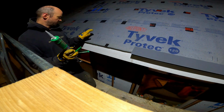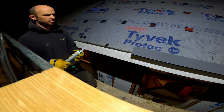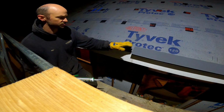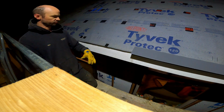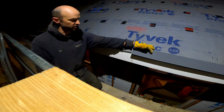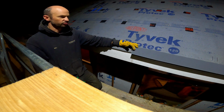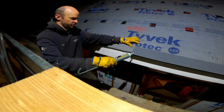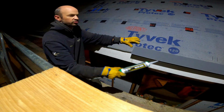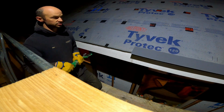Checked and tuned up the fit on the middle piece, made sure it was gonna go. And now, gonna put some roof sealant on these. So these are one of the few places in the roof system where no water should ever get here. But if it did, it could travel laterally and find its way through a seam. And so you just do vertical stripes, continuous beads of sealant down these lapped areas of the telescoping joint. And that should stop that.